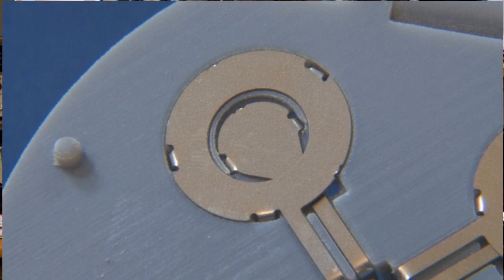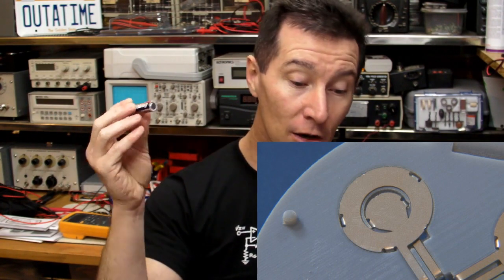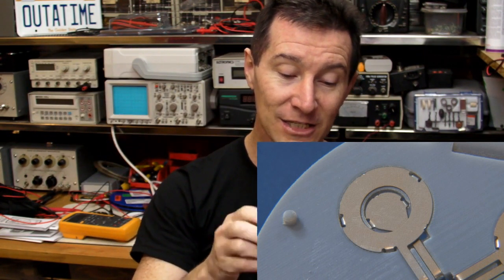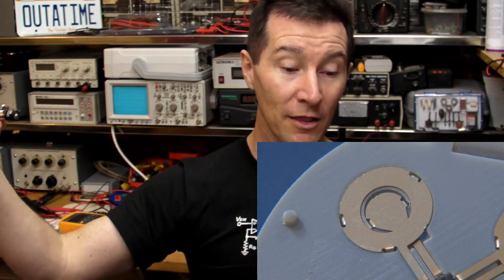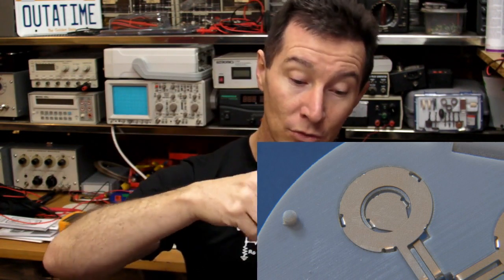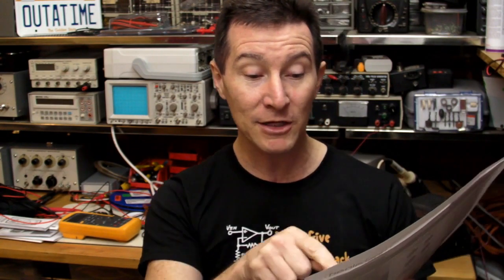Curiously, take a look at this — one of the terminals from their InstaLoad battery PDF document. This one is only suitable for products that have a cylindrical tube, like a keychain flashlight, where the battery gets loaded into the actual tube. Unless there's something that aligns the battery on that axial plane, you can't just use this terminal to slide the battery in, because the nipple will just short out to that complete circular outer negative ring. They don't actually show this as being used in any tubular type system, but that one clearly does.